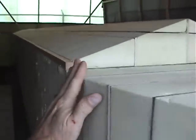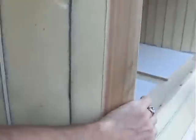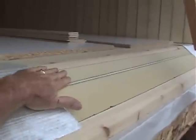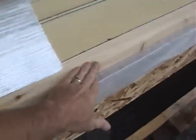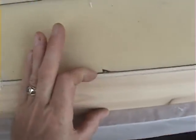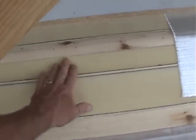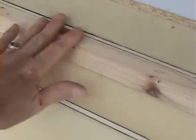There's going to be another piece here that I still need to make and it'll have a curve because that's the bow. On the front bow I've got another piece of cedar that's about an inch and a half thick — again for impact protection. If you look at the front, this is the floor section with an angle I've made, which is the nose of the boat. I've got an inch and a half of cedar all along there so the fiberglass will last much longer if it hits the dock.